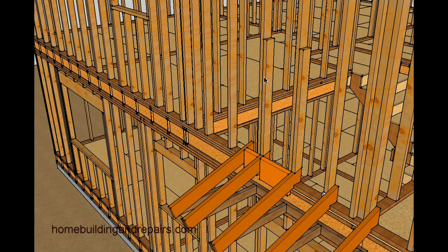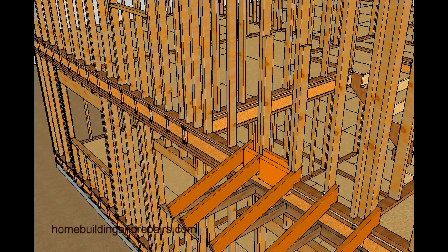Another thing I used to do when building these roofs is nail 2x4s onto the wall studs where I was connecting the rafters to, and run them all the way up to the roof. If you wedge it in with a seat cut here, it's going to give it very little room to move. This is too long of a cantilever to span without getting any movement.